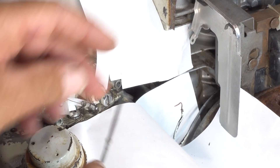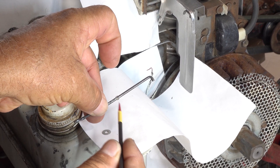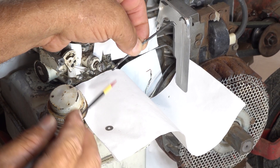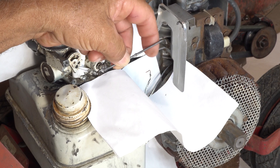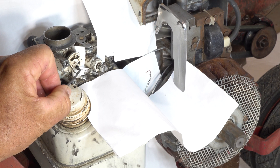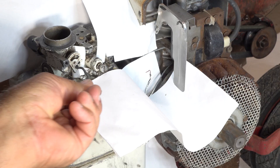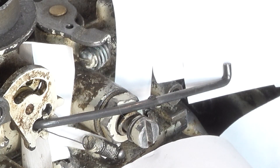But before we put that together, we have to put on this linkage. There's a crimp right here, and this washer goes on the side that just has one turn to it — this one has two turns, this only has one. The way you put it on is it's going to go in the same hole as this spring right here, but you actually start all the way back like this, then put it in right there, rotating 180 degrees like that. That little crimp is what stops it from going back further.